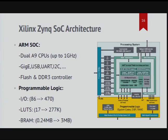So for those who haven't used the Xilinx Zynq or haven't heard of it, I'd be surprised if people haven't heard of it. But yes, I'm a pretty big fan. We've been using this for over 3 years now. Where I think they really did something right was they put the ARM processor, the CPU, front and center. I love the fact that I can boot into a regular Linux system, never having turned on the FPGA, and be up and running. So I boot it like a normal processor. And then the FPGA is, of course, crucial, instrumental, but I do that later. I don't have to bootstrap two things at the same time, which was generally the case in the old way of doing processors inside FPGAs.